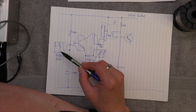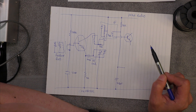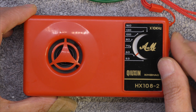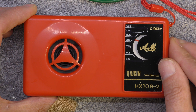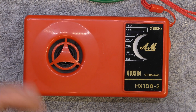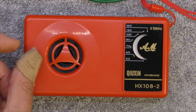The Q of this isn't terribly high, so there's a little leeway if it mistracks, but too much mistracking means very poor sensitivity. That's basically what the converter does in the red radio. It's quite sensitive - it has two IF stages so I'd expect it to work well. It's certainly pulling in Radio Caroline, though the sound quality is what you'd expect from a pocket radio.